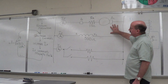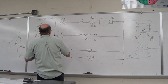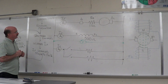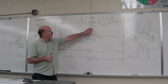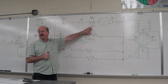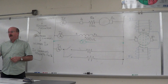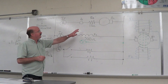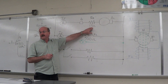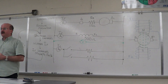We've got our armature in parallel with the shunt field, and we have our voltmeter out there. Everything is in parallel. What I did is I broke out the armature internal resistance — you can't go out and buy a resistor for it. That internal resistance is made up of the coils and wire; it's all the resistance of that copper wound inside the armature. This is going to cause voltage drop and power loss in your armature.